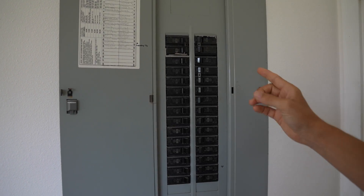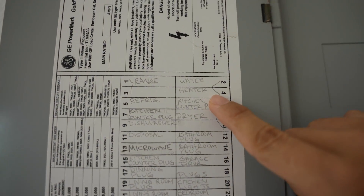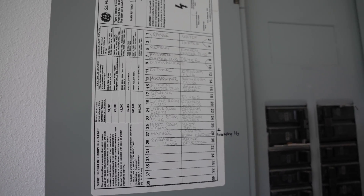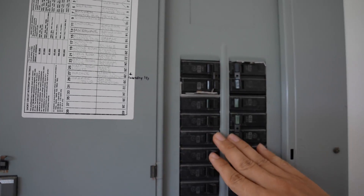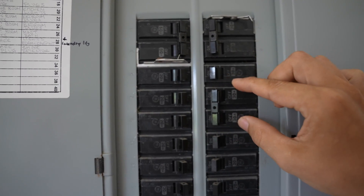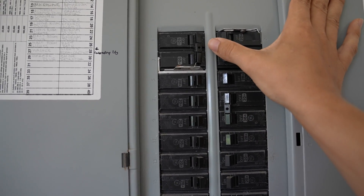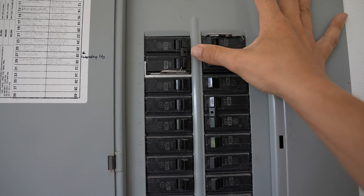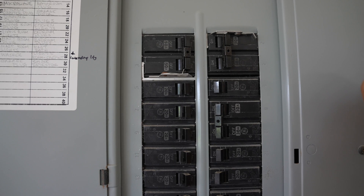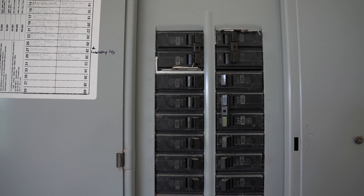If you are fortunate like me, your circuit breakers will be labeled. If your circuit breakers are not labeled, then what you are looking for is a bigger breaker. Electrical water heaters are going to have a two-pole breaker — these bigger ones where two of them are combined. On most breaker panels there's not very many of them, so your options are to turn them off one at a time and go check the water heater to see if that's the one, or simply turn all the big ones off and you know for sure that the power will be off.